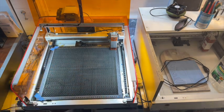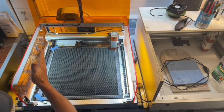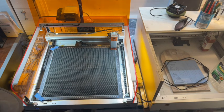So for me, that's what I call calibrating my honeycomb, getting it so that it has a definite position, that it's running nice and close, parallel to the X and Y axis. Well, thanks for watching. You might see I'm actually editing the video right now. That gives you an idea of what I mean by calibrating the honeycomb, giving yourself a precise spot reference so that you can use the scale on the X and the Y to just drop things in and use exact or absolute coordinates.